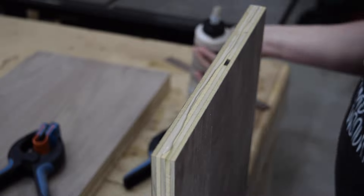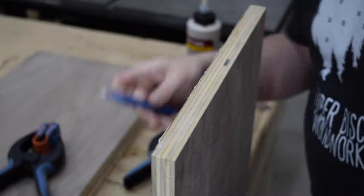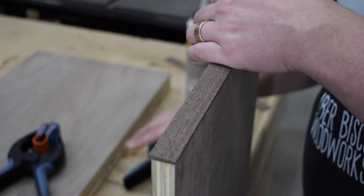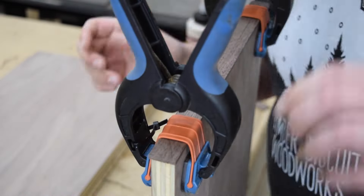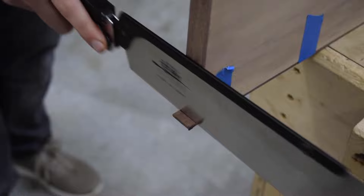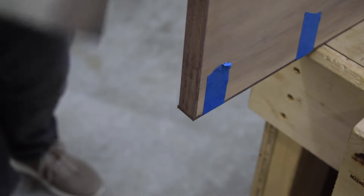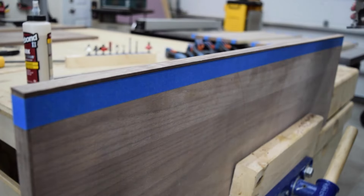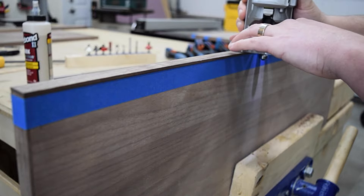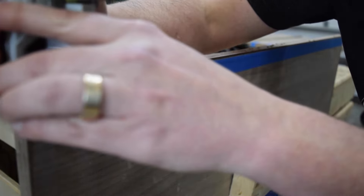With the shelves cut, I glued an eighth-inch strip of edge banding onto the plywood edge, leaving an overhang on both sides. These bandy clamps from Rockler work really well for clamping the strips in place. I trimmed the banding flush with a Japanese pull saw. Then using a trim router and a flush trim bit, I cut the banding flush to the surface. I like using blue tape to stop the bearing from marking up the veneer. Then I sanded the edge banding until it was completely flush.